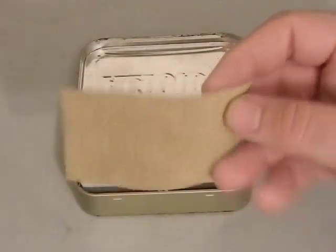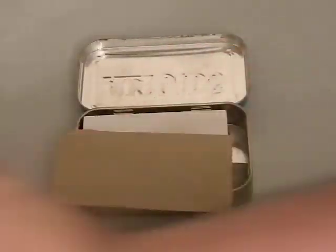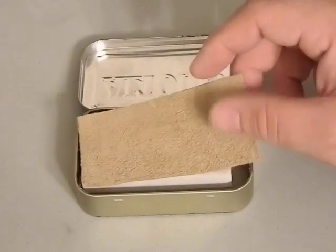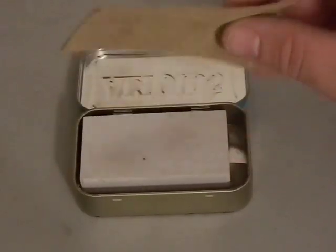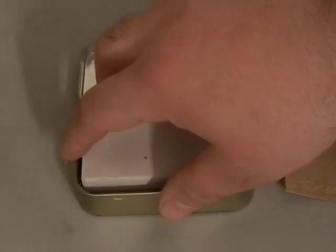Here is my strop, which is a little piece of 1mm vegetable tanned leather. I think this entire sheet that I cut it from, which you can see is a pretty big sheet, cost me maybe $2, scrap at a hobby store. So you can cut as many of these as you can fit in here, or you can add sandpaper, guys. If you don't want to do the whole leather thing, you could add in all kinds of automotive sandpaper, 1000, 2000 grit sandpaper, which will pretty much effectively do the same thing. You can strop with the fine grit automotive sandpaper.